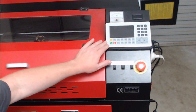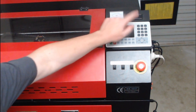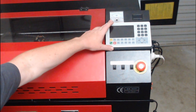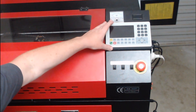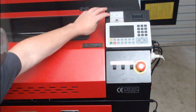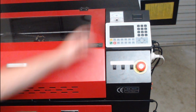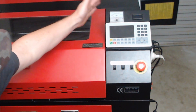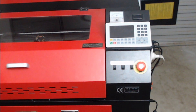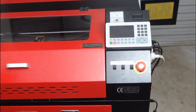Another thing I didn't like about the machine when it came was that it had no gauges. I've rectified that by installing an amp meter as well as a temperature gauge. The amp meter lets you know what milliamps the laser tube is outputting. I've fitted one that ranges from 0 to 30 milliamps — that's the best gauge scale to use. Most of the time on an 80-watt laser you'll be cutting at a maximum of approximately 25 to 28 milliamps, and I'm now getting extremely good cuts between 10 and 20 milliamps.